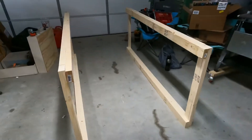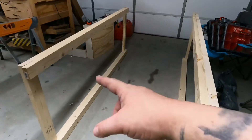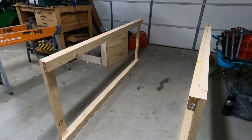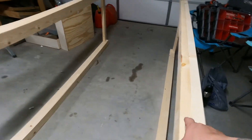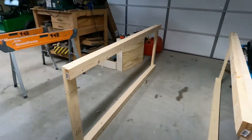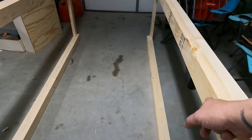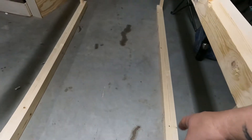The structure is sitting out here and I've measured it out. It needs to be four feet across — that's just for demonstration right now. Taking into account three inches here and three inches there, I subtract that from 48 and get 42, so I only need to cut 42 inches. I'm going to pocket hole them.